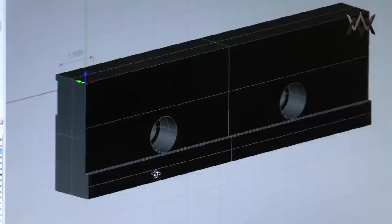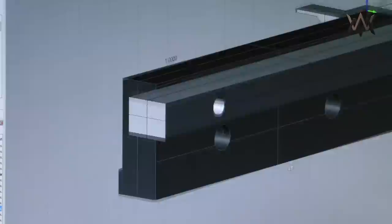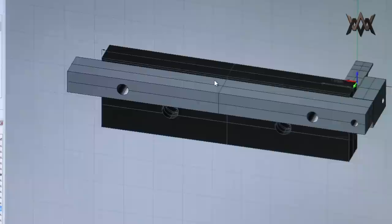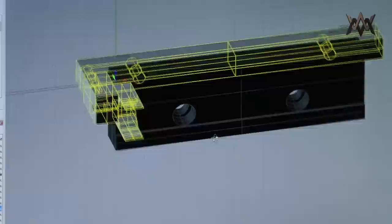Turn that on right here. Okay. So what this fixture does is a bar, it's a couple of pieces of steel, but it's this long bar that rides in that channel. And the reason I have it riding in the channel is so it will accommodate different barrel lengths. It can just move all the way out to accommodate rifle length, carbine length, mid-length barrels.